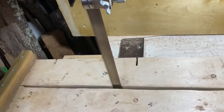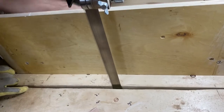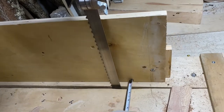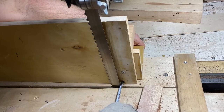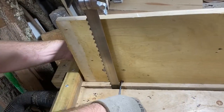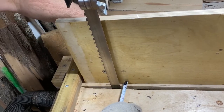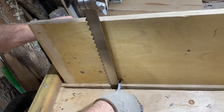Okay, I'm gonna turn the saw off for a second — it's gonna take a while to slow down — but I'm gonna get my fence back on here and resaw this from the other direction to get a uniform thickness of about three-eighths of an inch. I do have some markings on my table here but they're not terribly accurate, and some of them are markings for setting wet wood. This wood is dry to start with. I've got my son with me today helping out a little bit. I'll push the fence over to just about three-eighths of an inch — maybe give it just a bit more; I'll sand it down if I need to. It's a lot easier to take wood off than it is to add wood back. When in doubt, cut her just a bit thicker. Plus you're working with a bandsaw — these are not really intended for finished thicknesses. That ought to be a half an inch, which should give us around about three-eighths of an inch finished.